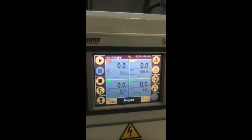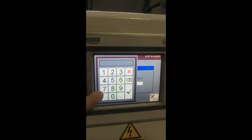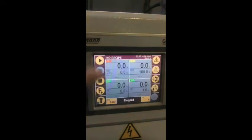If you hold the stop button for a few seconds, all current parameters are reset and the current batch immediately stops. By resetting the blender, the material in the weigh pan is not counted as a valid batch. If no user is logged in, a key icon appears in the upper display — press the key or tap the input box on the screen, then enter your password.